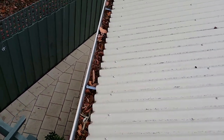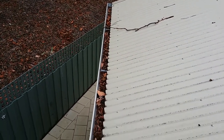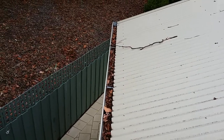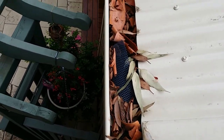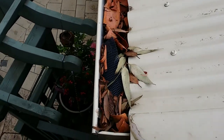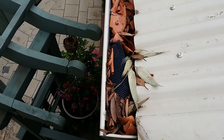On the outside of the pergola I also chose to use a wide gutter which I can access fairly easily with a ladder. Using the mesh to cover the stormwater pipe does require some maintenance — you can't just leave it, because if you get too much collection in your gutters and a heavy downpour, the water is going to cascade over the edge of the gutters.